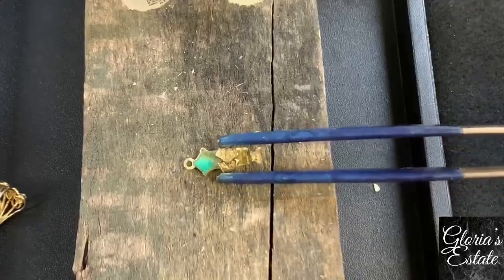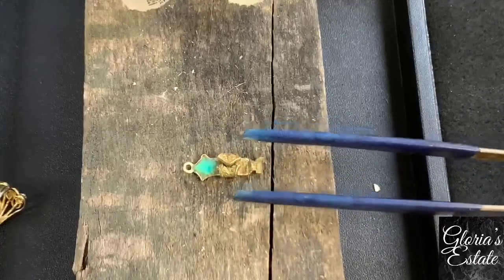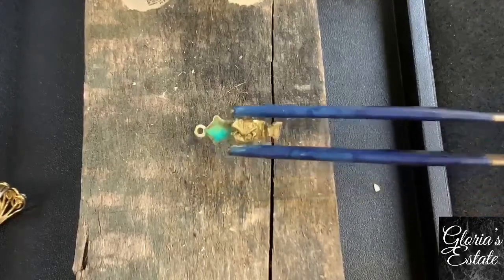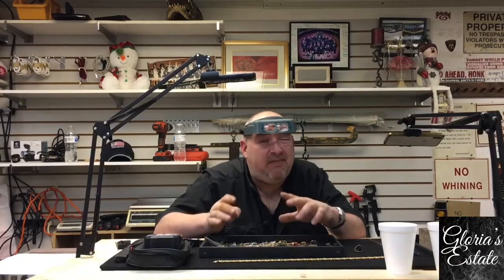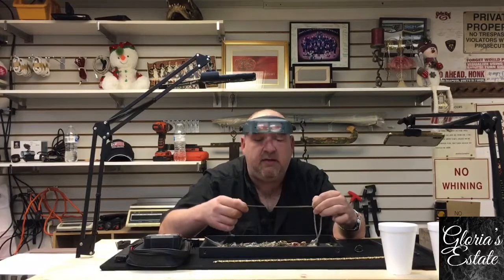And what it's doing is burning away any of the metals in this piece that are non-ferrous. So it's burning up any copper, any brass. And if we actually took this and soaked it in there, within a couple minutes, this piece would be reduced to absolutely nothing. It would completely dissolve into that strong acid. I'm going to tell you, you can order this stuff online. Don't recommend it a lot. But if you're purchasing a lot of secondhand metals off people you don't know, or are unsure about the history of, then absolutely.